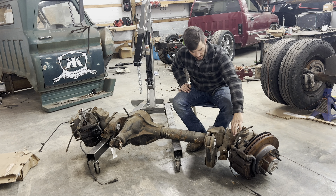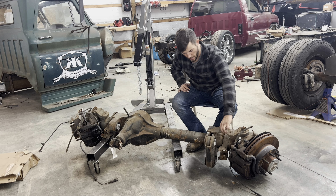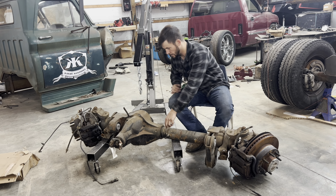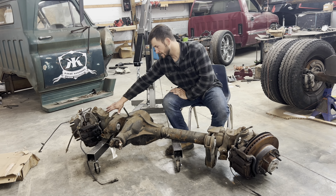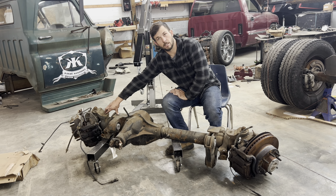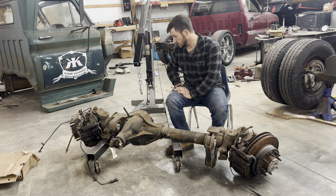The truss is basically going to be coming — I'm going to weld it onto the knuckles, down onto the tube, and across and over. This one is a little different because it's cast — the knuckles are cast. I'll take a torch and preheat before I weld; I'll explain all of that in the video when I get to it. I'm ready to start — I'm going to use the plasma cutter and grinder to start cutting off brackets I don't need.